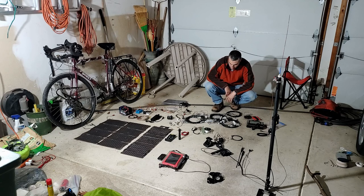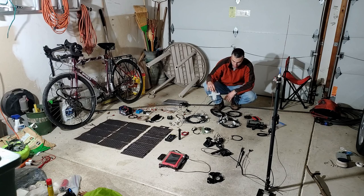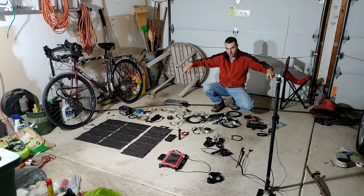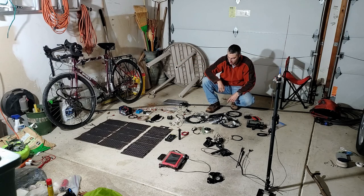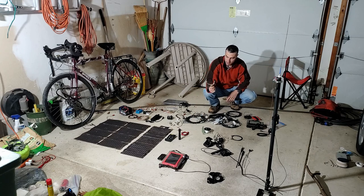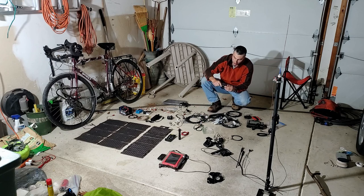As far as getting the antenna up, again, this is the center point. How I set this up usually is an inverted V configuration. So the feed point is the high point, and then just like an A-frame style tarp or a tent, you drape the sides off, sloping down towards the ground at angles. So you really just have the one support, if you will. To get that up in the air, that's what I use the slingshot for. So I've got a slingshot and a fishing sinker. And then this is, I want to say, 10 or 15 pound test monofilament.